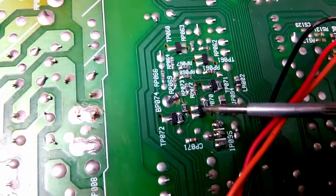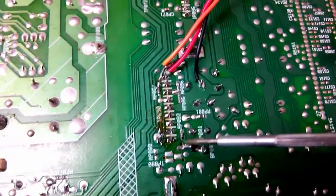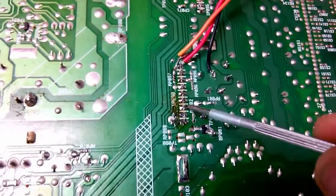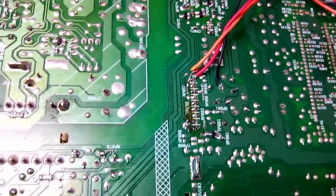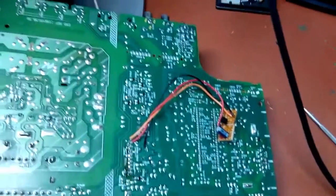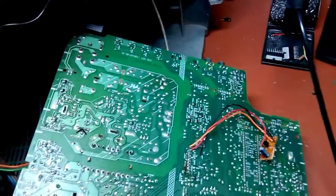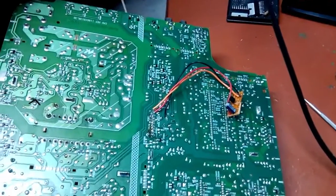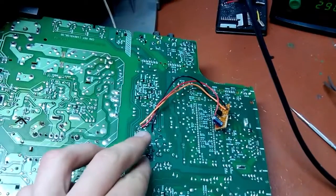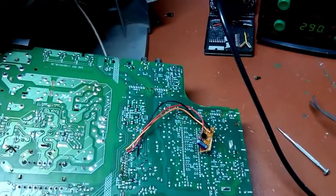I replaced this transistor, this one, this one, this one, and this one as well. Since one transistor is very close to this IC in a SIP-9 package — which is a linear voltage regulator with dual outputs — I mocked up another IC. It's supposed to be an STV8130, which has a 3.3V fixed output plus adjustable from about 3 to 16V; in this set it was adjusted to 8V. So I mocked up a KA7630, which is an 8V fixed voltage regulator with three outputs.